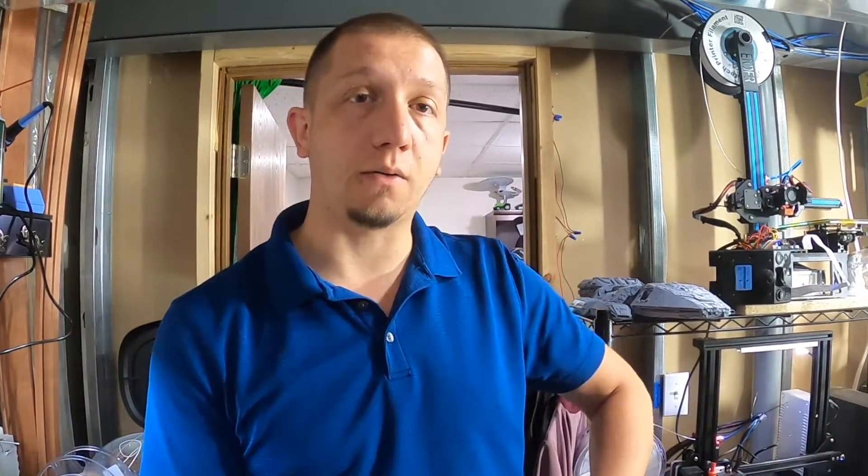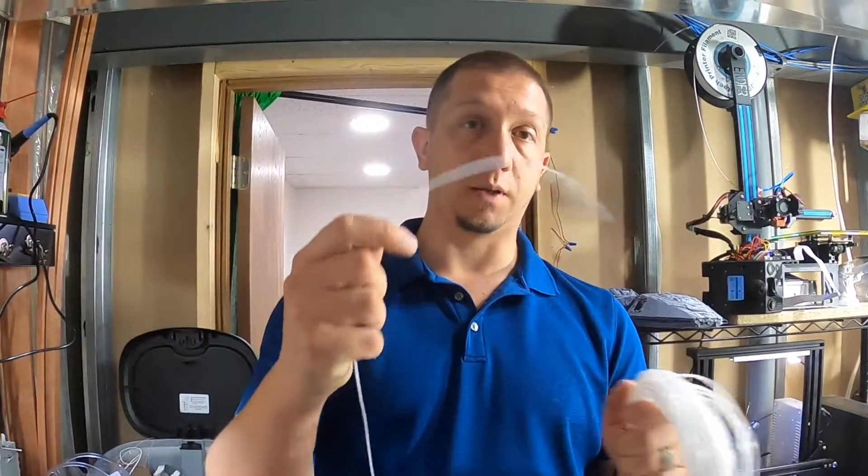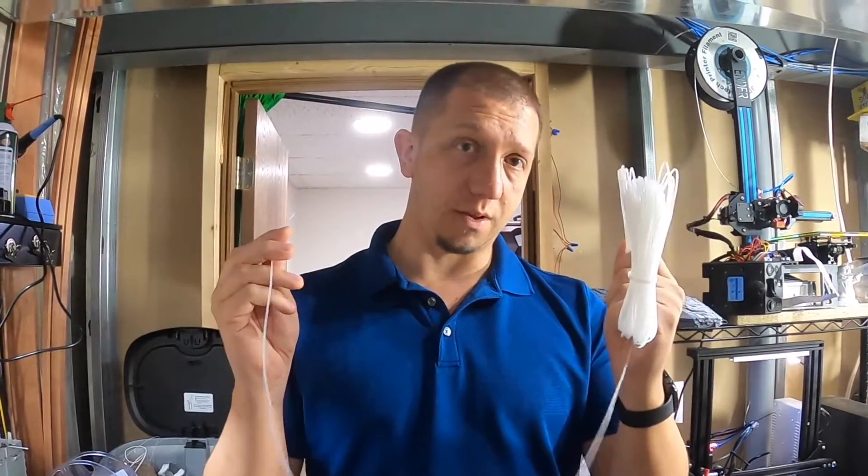Here's the Ender 3. The first thing we need to do is preheat the printer because any filament that's down in the hot end, we want it to come out with the rest of the filament. If you just try to yank on it, you're going to break something — your Bowden tube, the filament itself, or it's going to become a real big mess where you have to take everything apart. So preheating does that for us. We're going to heat up to 215°C, which is what Inland PLA normally prints at. Then we'll run a little bit of cleaning filament because I'm changing filament types and I don't want PLA and PETG mixing in that hot end.